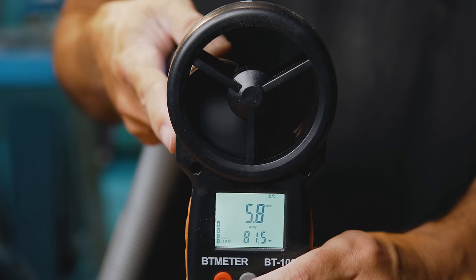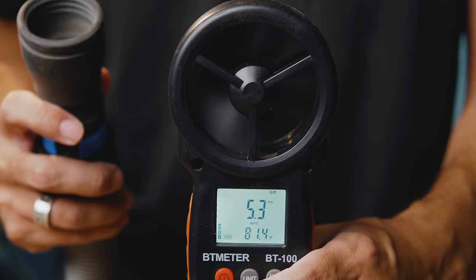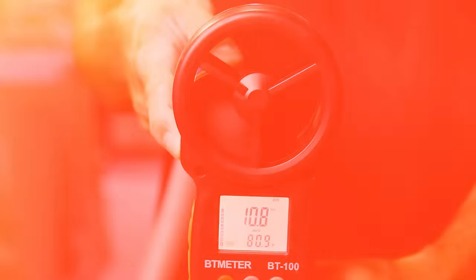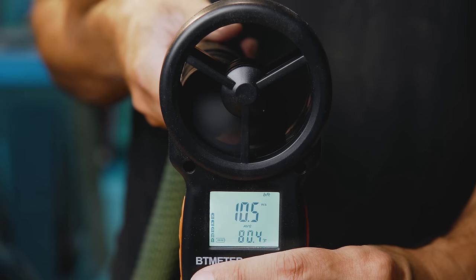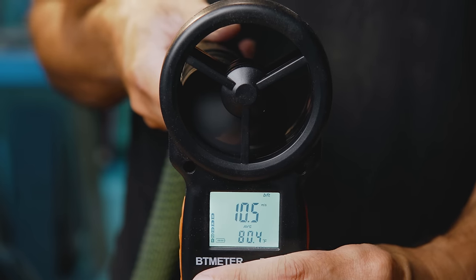When you add a cyclone you get a natural loss of suction. The Black Friday Rigid with a cyclone dropped from 7.7 to 5.8 m/s — a 25% loss, which actually makes a noticeable difference at the end of the hose. The new Rigid dropped from 12.1 to 10.9 m/s — about a 10% loss, which wasn't really noticeable. The Festool with the cyclone dropped from 13.6 to 10.5 m/s — a 23% loss, which was disappointing but still in the same neighborhood as the brand new Rigid.